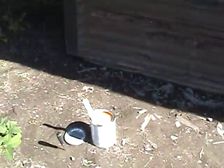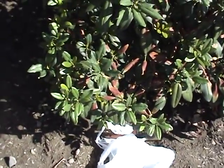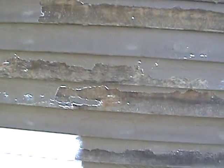It's also good to have your paint numbers. What I'm going to do is oil prime. I'm using a real cheap brush — I don't want to use my good brushes on it because cleaning up oil is hard to do. You have to use thinner and it's messy. If you use just some cheap two-dollar brush, you don't have to worry about it. I'm going to mix all this up, get out my brush, and put on a little pair of latex gloves. That way, if you get any oil on your clothes or your hands or anything else, it doesn't come off, so you just have to be careful with it.